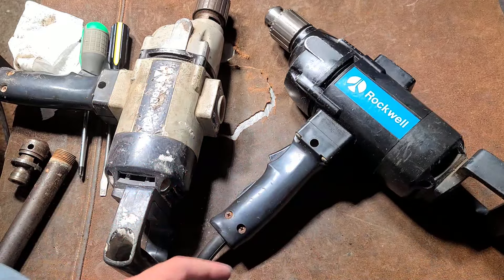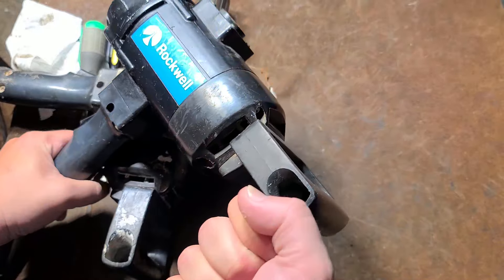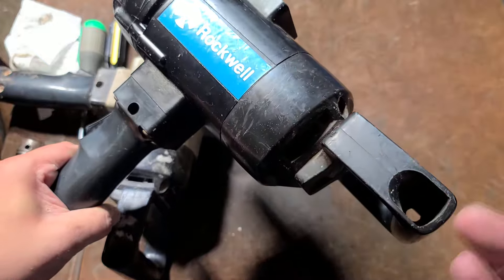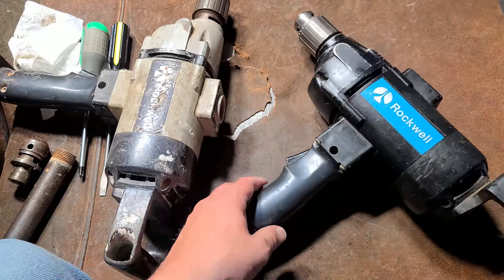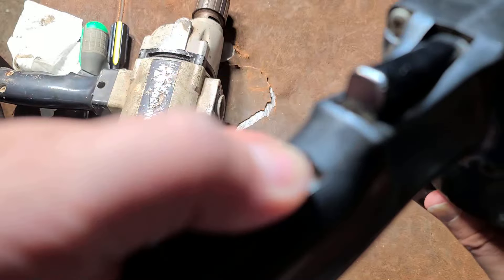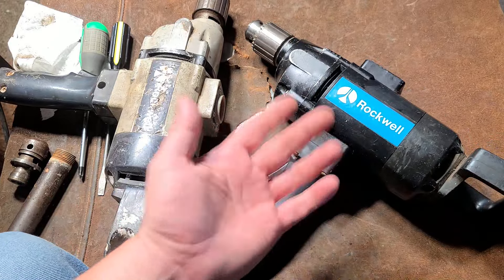There are multiple versions of these drills with different RPMs — for example this one's 600 RPM, this one's 500 RPM. They also had D-handle versions like reciprocating saws or rotary hammers where you have a handle right in the back of the tool shaped like the letter D. That's also why you can see provisions on the gearbox threaded for a side handle — that side handle exists on the D-handle versions but not on these with the pipe handle and long drive handle, just like the Milwaukee Hole Hogs. Pretty standard switch setup — this reverse switch is still a rocker, the old Porter Cable was metal and this is the same switch in plastic, then they went to linear, but you can pretty much replace them with each other.